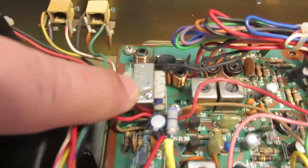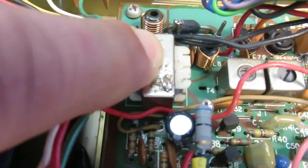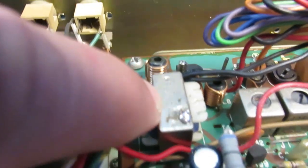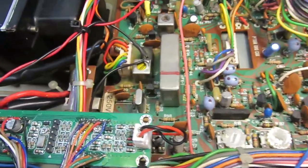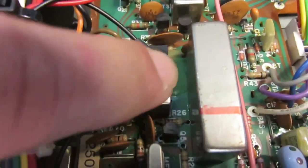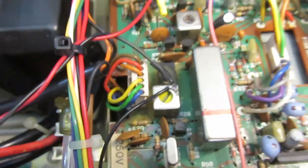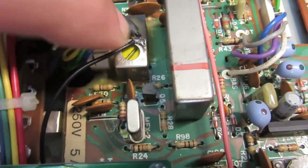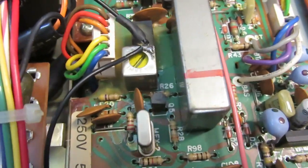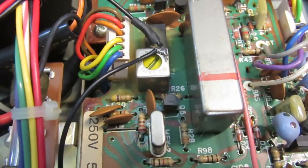And you see, initially I'd put the ground to this transformer. This is the input to the DC. It goes through this transformer. I figured that's the best place. It was very quiet, but after I had to change this over, that wasn't good enough. So it turns out I took a wire and I went through this whole unit to find the best ground, and the bottom side too. Turns out it was right here next to this crystal. Once I put the ground here, it just went away. It's like, wow, crazy, right? So that means I was able to tie both grounds and not float the ground like I did previously. Okay, so does that make sense? Yeah, you just have to test to make sure where these connections go to make the least amount of noise.